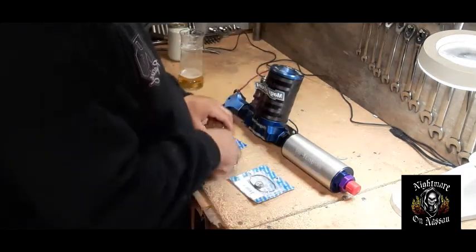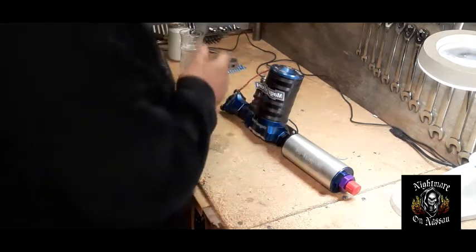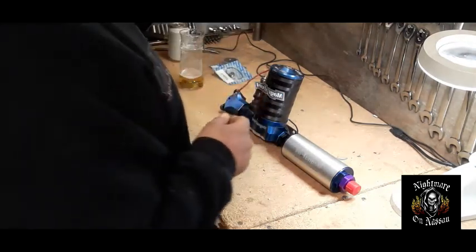I had it sit for months, so I ended up mounting it on the car and after like the second day it started leaking out of the weephole — just the way he described. So this weephole here is where fuel starts coming out when the seal is bad. I ended up buying the rebuild parts. Here's the vane cup and here's the seals. We're going to go ahead and try this. According to his video, there's something that could be done — nothing major.